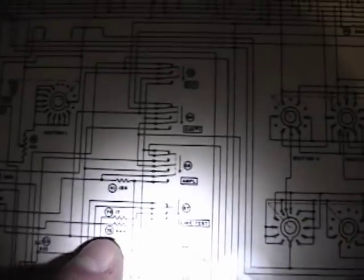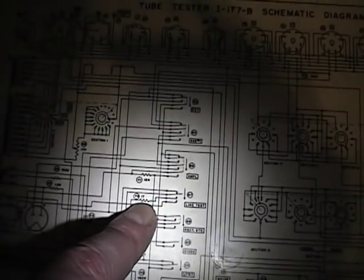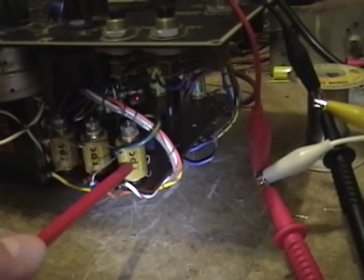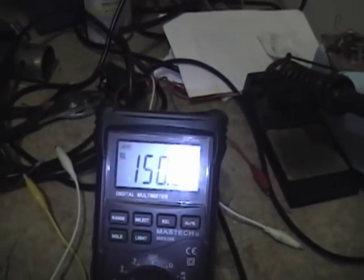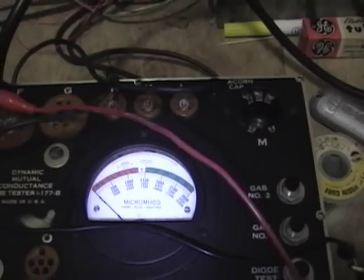What the author says to do is tweak this resistor right here, which has a nominal value of 17 ohms connected to the line test. Hopefully I just need to bring it down in value, because then I can put a resistor in parallel with it and tweak it a little bit. Here's that line adjustment resistor — it's easy to get at on the end. Mine measured about 14 ohms and I put a 390 ohm resistor in parallel with it, which drops the value down just a hair, and now I'm almost dead on. A little more tweaking — maybe a 330 ohm resistor will do the trick.